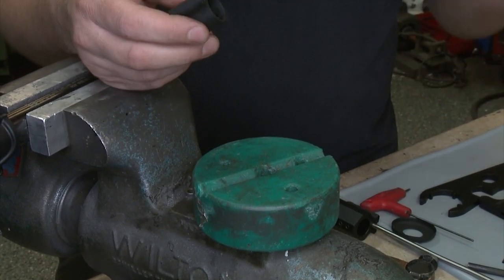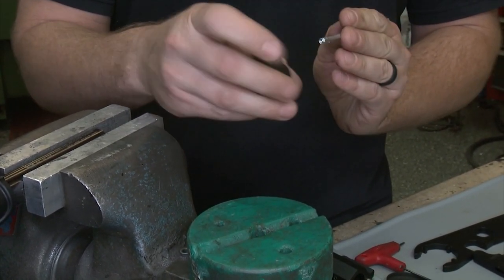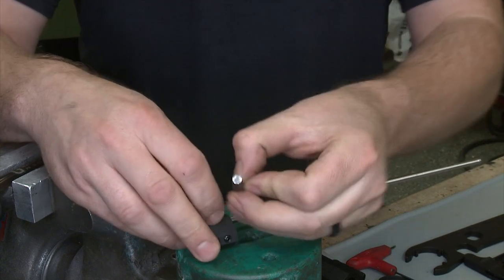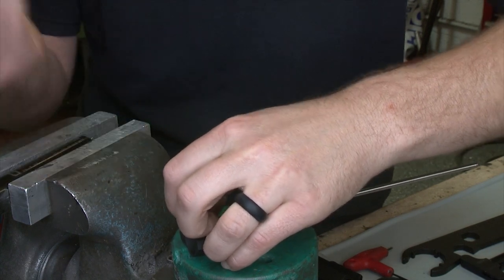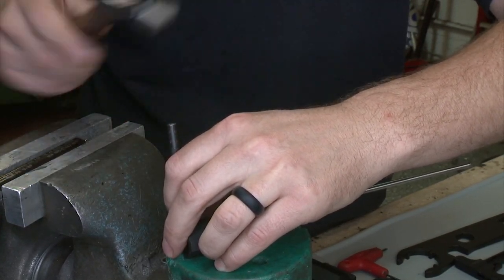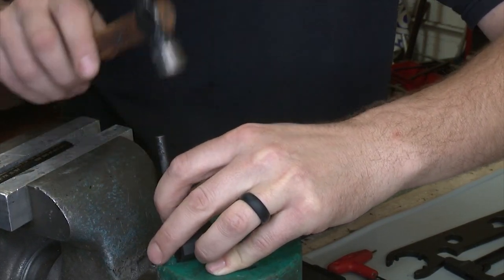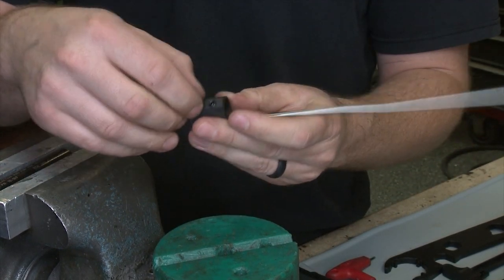Now we have our gas tube and gas block. The side with the small hole will be toward the rear — no place for gas to escape out the front, but at the back there's a hole in a hole. Simply slide in the gas tube, align the holes, and place it on a bench block. Use a roll pin punch — if you don't, you can damage the pin as it's going in. Use an ordinary six-ounce hammer and tap it in, and it should stick out evenly on both sides of the gas block.